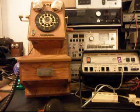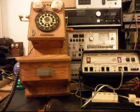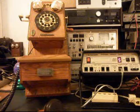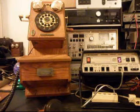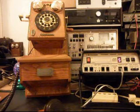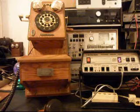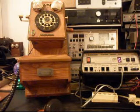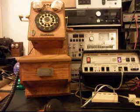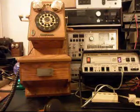Circuitry, mostly IC chips, has a design inside of them, a circuit that prevents what's called key bounce. In other words, the circuit recognizes that it has been activated, and it only lets it activate once. And when you lose that circuitry, or there's damage to that circuitry, what can happen is you will get the key bounce.